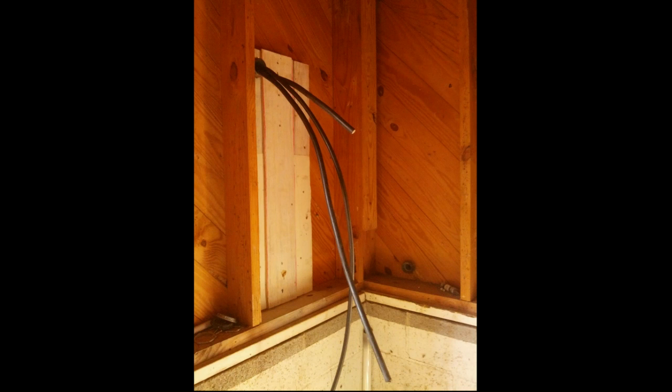You can see here I'm pulling the wires in. There are the two hot wires, which is a 250 kcmil size wire, and then the neutral wire is a couple sizes smaller. All three of those are aluminum. You can see this extra piece of plywood that goes down the center - that's going to be what I bolt the box into, and that leaves each side to have a little space between the panel and the backer board.